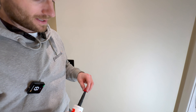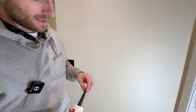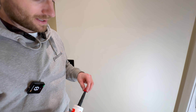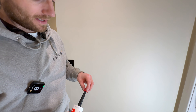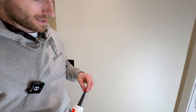We now need to caulk the top line. Obviously no wall is perfectly straight so we've still got some gaps - at worst it's only about a mil, a mil and a half, so not too bad. Ordinarily you would get your caulk gun and apply a line, then get your finger and rub it. What you actually get though is a very thin film of caulk that smudges out and spreads up the wall, filling the micropores in the paint. If you look up close - maybe on some architrave higher up - you can see it reflects differently and it's quite obvious you've got a thick layer there.